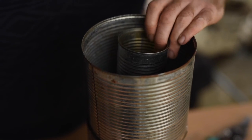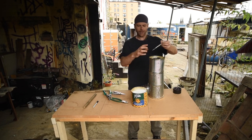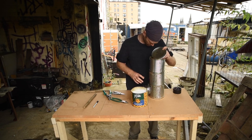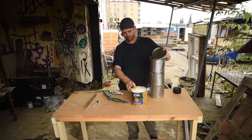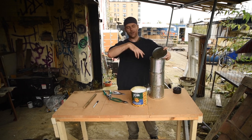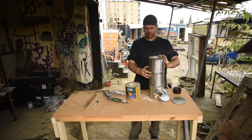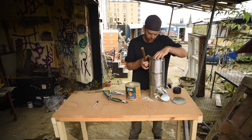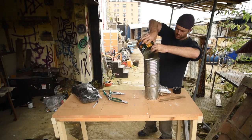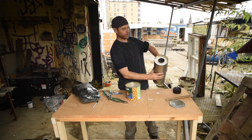One of the last steps is to fill this with perlite. It can be handy to use one of the lids you cut off as a shield so you don't end up pouring perlite into your chimney. Make sure everything is basically closed off — there aren't any huge gaps where it could pour into the burn tube. Perlite is quite fine-grained stuff, so it can find its way into the burn tube. Occasional bits here and there are fine, but a serious hole will just let it pour in — that's basically what the twisting wire was for. Pour the perlite in, get things nice and centered, and then use your stick to make it compact. Fill it up pretty much to the level of the inner tube.